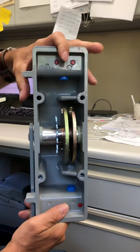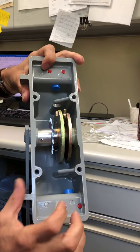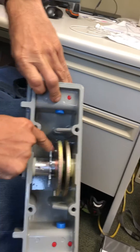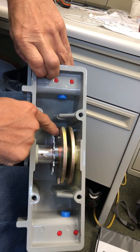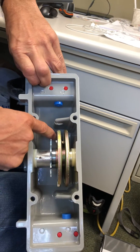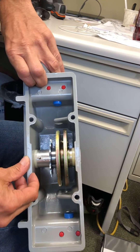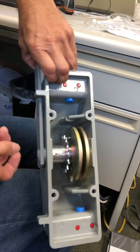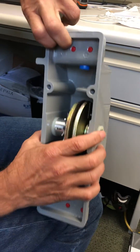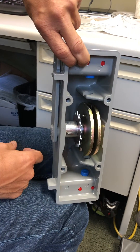If you receive a disconnect switch handle, it may be that the cover that comes with it has come off or was lost. In that case, you could cover it in the field to prevent this problem. The other possibility is that the disc is rotated wrong — you can take the disconnect switch handle apart by removing the collar pin and slipping the handle out, then rotating the disc to get it right. This is the proper position for these two-disc handles.